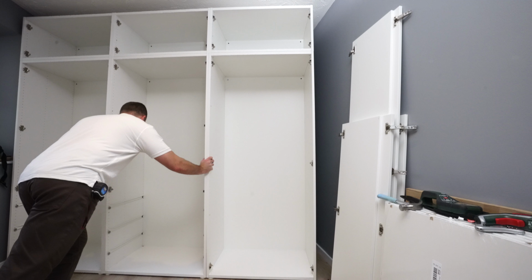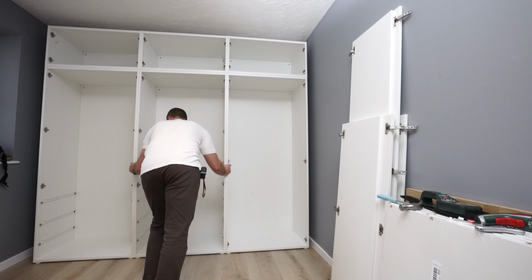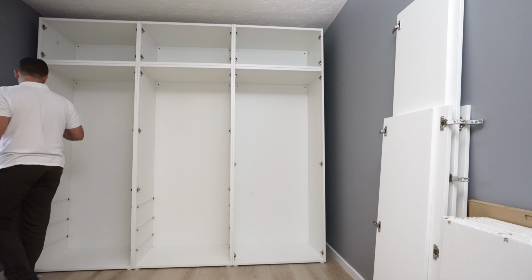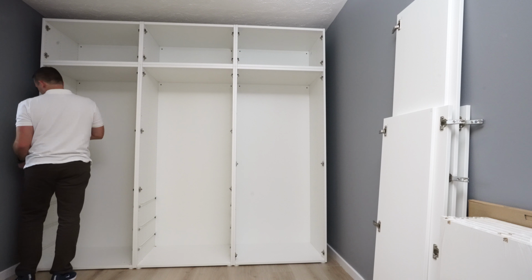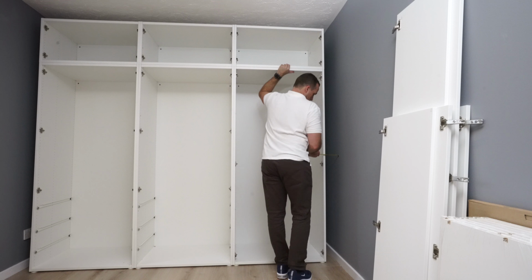And that's it, we push the whole frame in, and now you remember the numbers you measured before, from one side and the other side. Push it all the way in to the wall, to the skirting boards. Now I'm going to measure the exact same measurement as we took before we marked the wall with the drill. One side, other side.